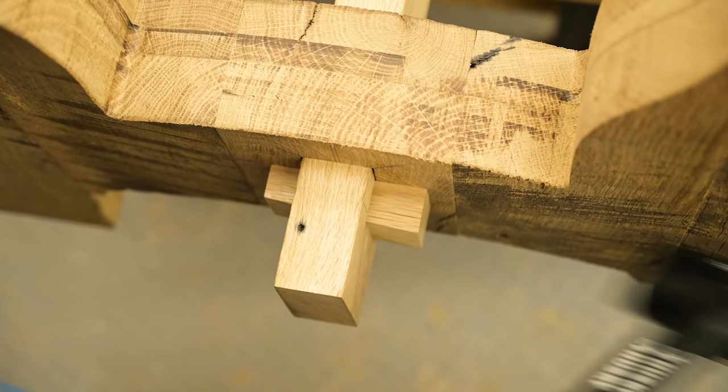With tables, the big thing to remember is you need rectangles, right? So as it is, without these, we don't have any rectangles. We have two sides and one piece. Once we have pieces on top, then we have that top stretcher, the legs, and then the middle stretcher. So we do have a rectangle. Once you have a rectangle that's all joined together, you have a strong base.